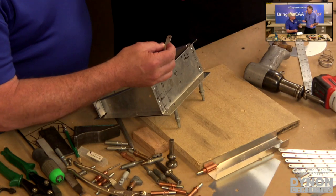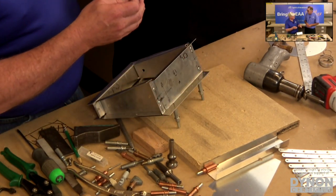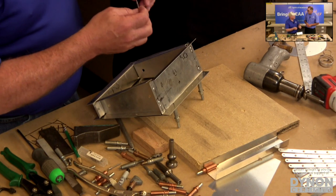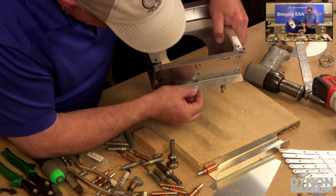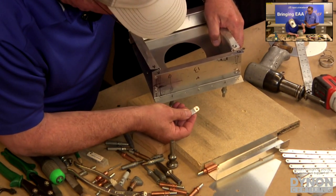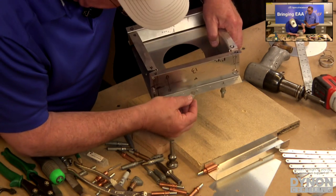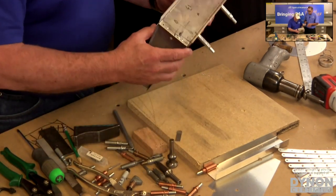That's called a pancake rivet. And especially if you do it too much and make that head too large, it'll crack and fall apart ultimately. So we'll check with our gauge, and look at that, it's just perfect. I don't know if you can see it in the picture or not, but I've got this calibrated hole that we know is the size we want that rivet head to be, and I slide it on. It just perfectly fits. So basically, that's a properly driven rivet.